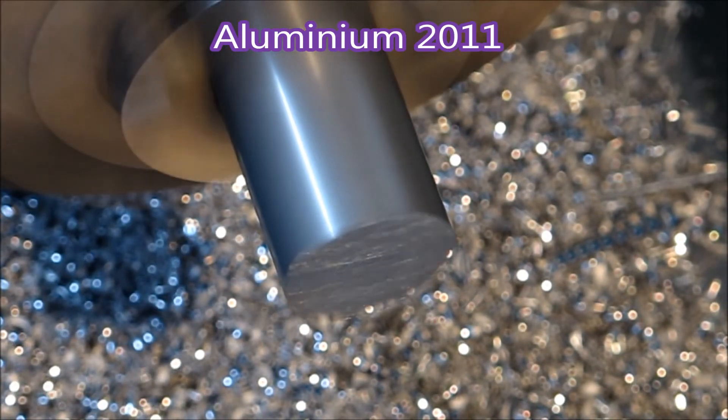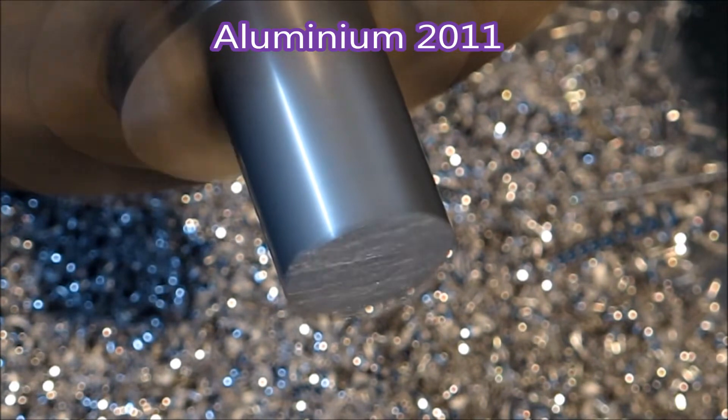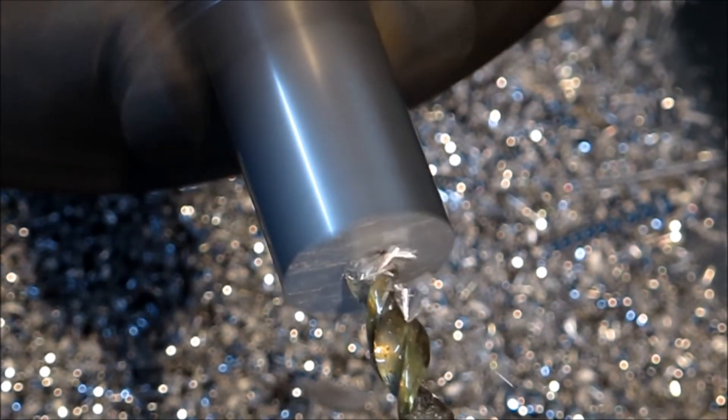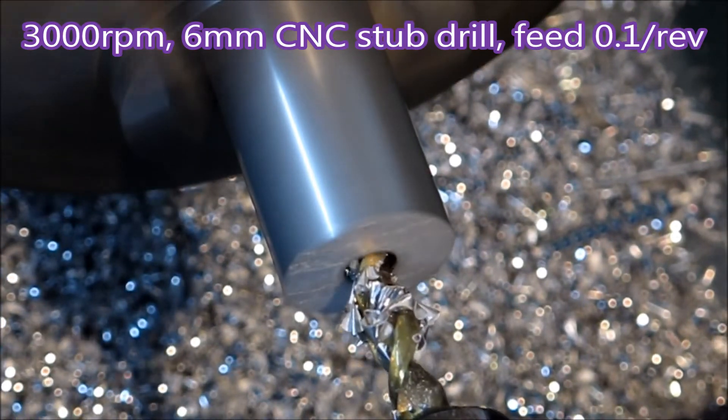There I'm just pulling the material out to the parting tool insert. I don't like to do that if the material is steel and it's heavy, or brass and it's heavy — it can knock the insert around.